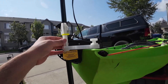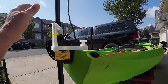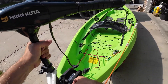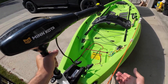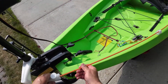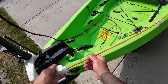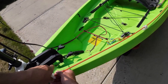Even without the washer it really wasn't coming out much, but when you're in the water and you lower the trolling motor — the lower tightening is all the way loose right now — this rod comes in. Just unscrew this a little bit, get the end of the rod all the way in — it doesn't go super far — and tighten it down so it doesn't go anywhere.